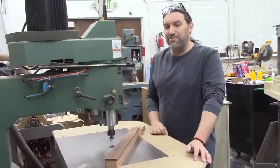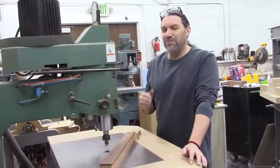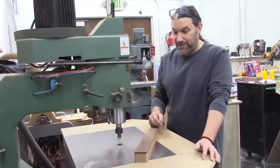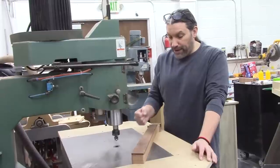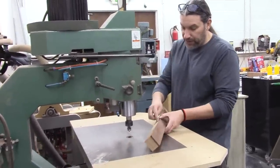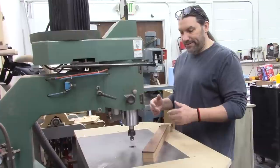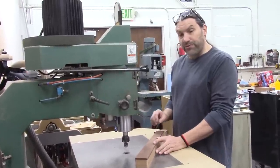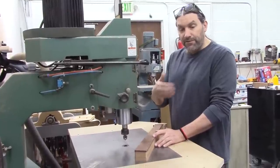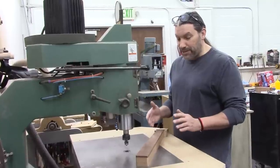I got home and realized there was no video for this part, so please forgive the lack of continuity. What I wanted to show you was how this StewMac binding cutter works on my pin router. The reason we're putting the binding slot in before the fret slots is because it eliminates some opportunities for tear-out at every fret slot. There are 22 fret slots and 44 places where tear-out can occur — it doesn't eliminate the possibility, but it reduces it. I'm going to do it in two passes and go down to a quarter inch.